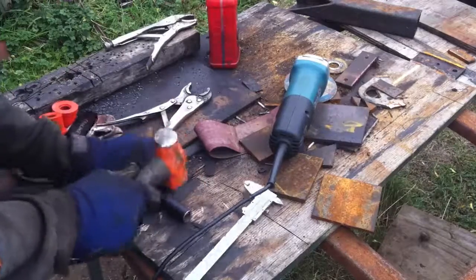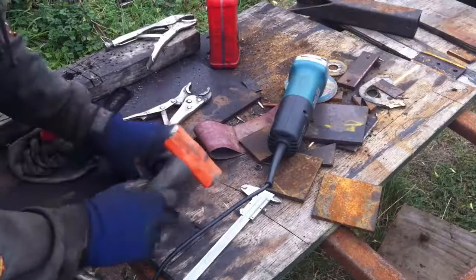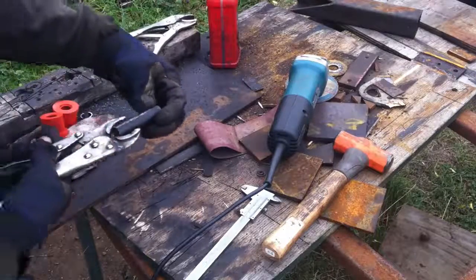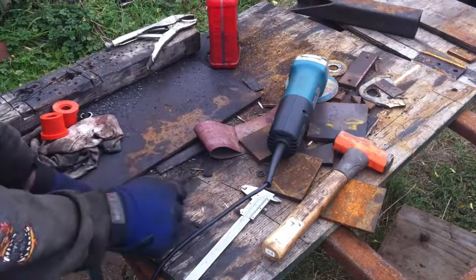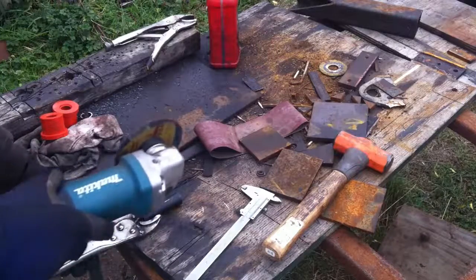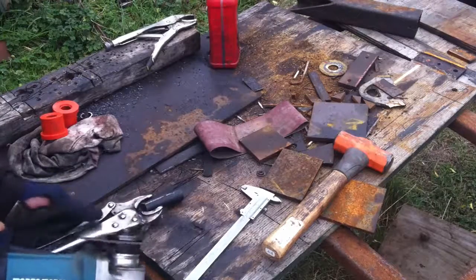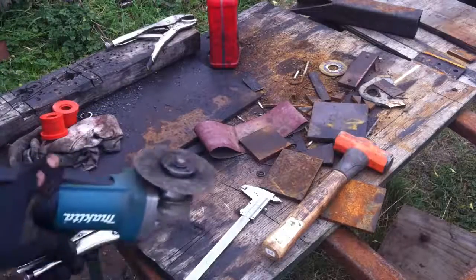It takes just a little bit of work to get that to fit like you want it to. My experience tells me I'm going to have to go back and cut this one more time. I like to use the vice grips or bench vise because you can put pressure in — when it's closed, cutting actually takes out a full blade width again. That's really important, because otherwise you'll have to keep going back and grinding. This way, I know each cut takes out about one and a half millimeters at a time from the full diameter of the tube, and I can close it up a full one and a half millimeters each time.